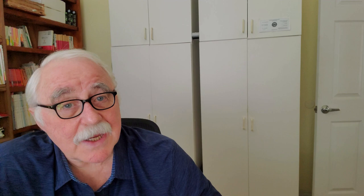But most of my boats are what I would call variable V, where the dead rise changes throughout the hull section. They start out at a fairly steep dead rise up in the bow — like a deep V — and then going back into the stern it becomes like a shallow V, or some of them even flat. A variable V works best for me because you can make it plane, displace, or semi-displace, and they tend to be easier to build out of plywood — very useful for home builders.